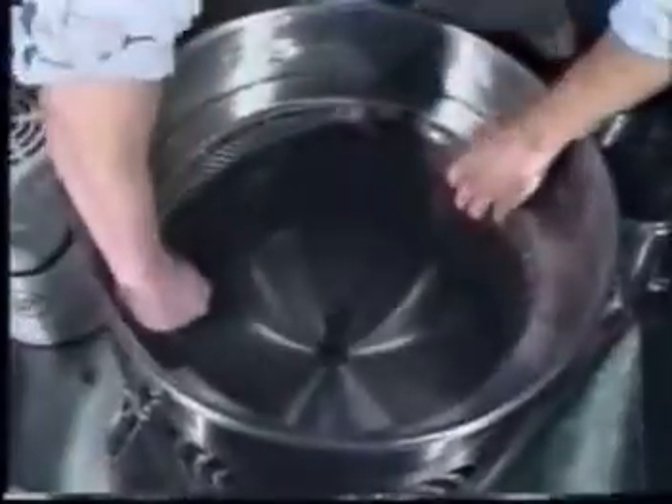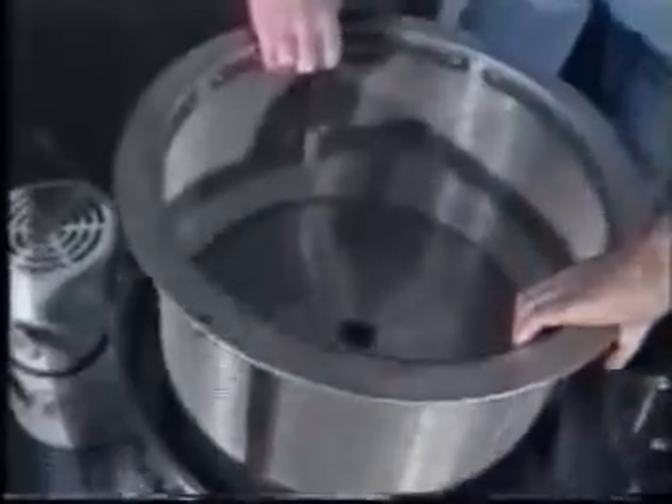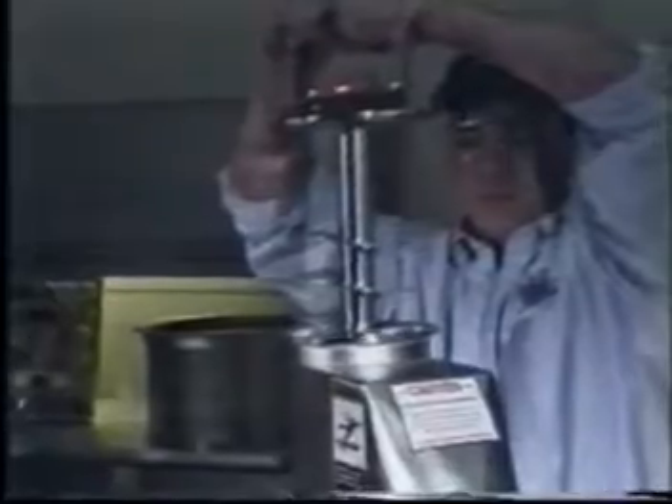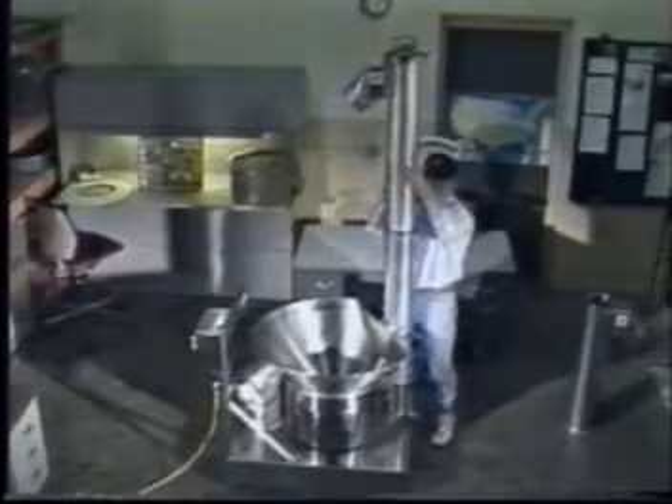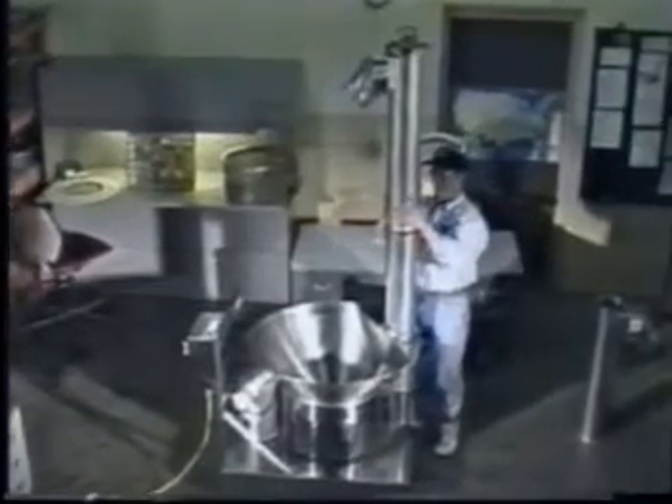A variety of internal components may be readily interchanged by hand in seconds to meet your process requirements. A high-speed continuous spiral elevates the material before exiting through the discharge chute, which rotates. The modular elevator may be retrofitted by adding or removing sections should your conveying distances change.